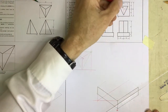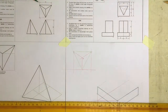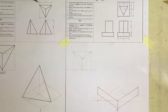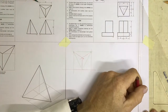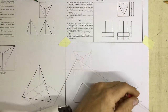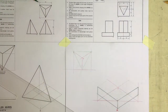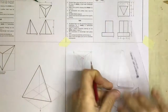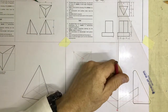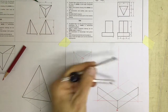You can see that the center is going to be in the middle of this thing. Same story over here — I'm going to come along here, draw a line coming out like that, drop a line going down like that from those corners, and draw a line going back at 30 degrees over here, meaning that I've found the center O that I was talking about earlier. From there I'm going to take a line going straight up, and I can see on my drawing over here that it goes up 50 millimeters. So I measure off 50 millimeters and I mark that off.